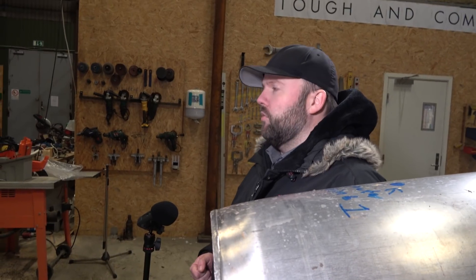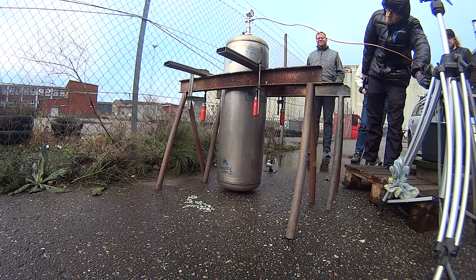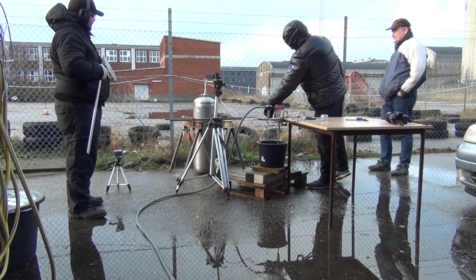That's the only way to see how they burst and where they burst. It's been a depressing matter for the so-called Department of Destructive Behavior. We tried a couple of weekends ago with a hand pump and tried to burst these ones, and we came out at a maximum pressure of roughly 64 bars before the hand pump gave out. So we needed some heavier equipment, and one of our specialists brought a pneumatically amplified water pump capable of roughly 450 bars of water pressure — so that should do it.